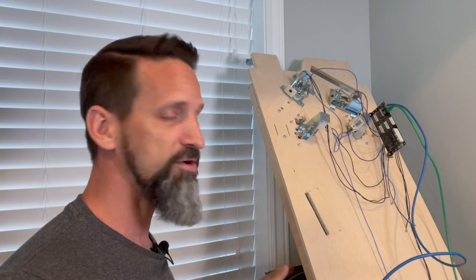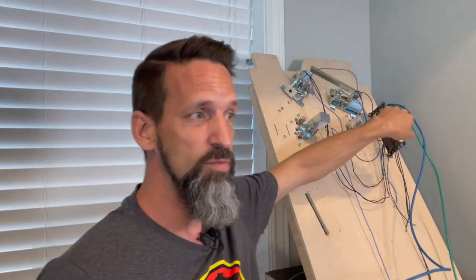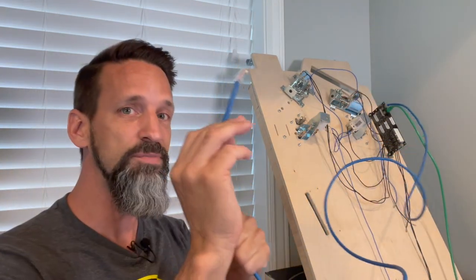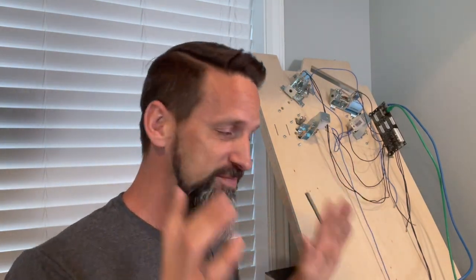So you go from your nano controller's out into the first node board's in. And then when you get to your last board, and for us it's the same board, you go from the out port back to the in port on the nano board. And now they'll all be connected. So for us, it's just two wires. One from the nano board to here, and then from here back to the nano board. Now those can communicate. So now we're 100% done with all of our wiring.